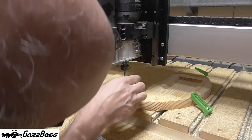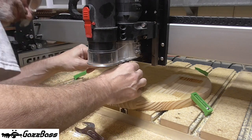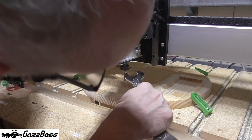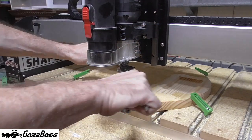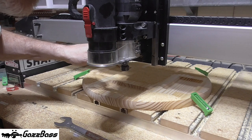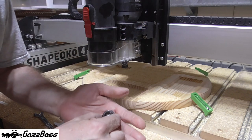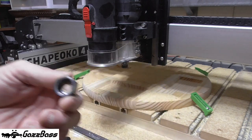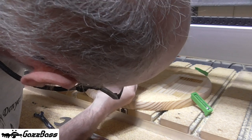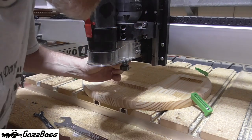That's the trays done. The program is now looking for an eighth-inch end mill per the drawing. I'm going to take this tool out. It's always important to clean out the collet after you're done with the previous operation — you can see there's gunk in there. The reason I'm doing that is because I don't want the tool to slip while I'm milling. Collet back on — that's clean.